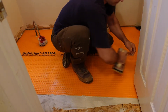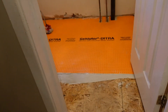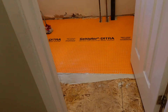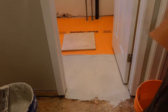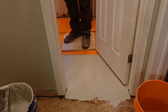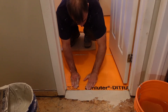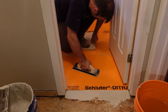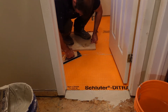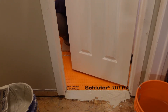When you stand or kneel on the DITRA it does indent into the mortar slightly. I could feel where my foot or knee had been just ever so slightly. I switched over to a piece of plywood so I didn't get that indentation. To fix it, I worked over the area with the float and after a few passes it settled out to the same level. If you just walk away after kneeling, you may have an indentation which might be an issue when you go to tile.